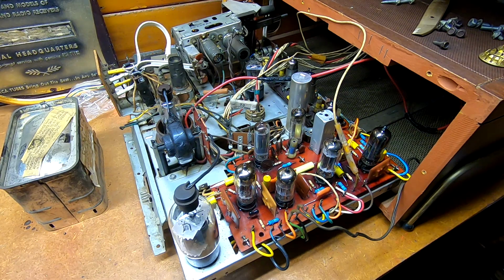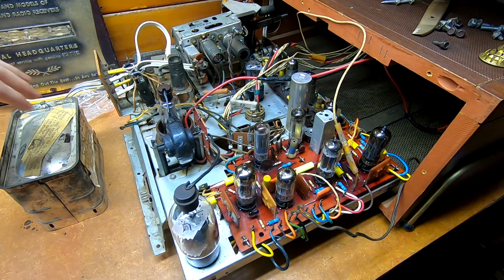The only thing I do not know is if I feed it in a video signal, if we would even get anything. That would require going through the IF stage, and I haven't done that yet. There's really only resistors in there, and I don't know. Well, maybe we could. Actually, no, because I can't get to the channel knob. Frankly, I don't want to try injecting a signal yet until I've dealt with the power supply. I don't want to leave this on long enough to try injecting a signal with how this is behaving. I don't know whether I'm damaging it by allowing it to go that long.